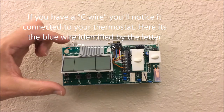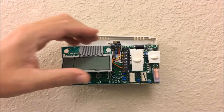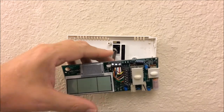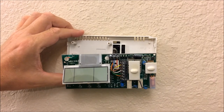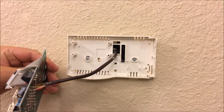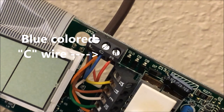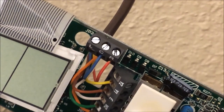Next, I wanted to remove the old thermostat's circuit board from the mounting plate fastened to the wall. The thermostat wire coming out from behind the wall is a pretty sturdy wire, so we had to carefully finesse it out from the clips on its mounting plate. Once loose, we can gently pull the wire from the wall, giving us room to work. Notice how small the screw terminals are on the old thermostat — it's best to back those out and undo the wire, or snip it close and restrip it, labeling them one at a time.